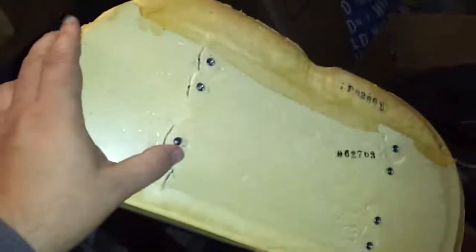Okay, taking it apart now. That's where I broke it — looks like there's a thick plastic plate, an epoxy or resin of some sort, and I snapped it. There are some extra holes here, but there are four bolts and I'm not using all of them. So maybe a wooden plate as big as this whole thing, bolted in with countersunk holes, to allow the original bolts to reattach — cut a sandwich and give it some support. I'll need to get a piece of plywood.